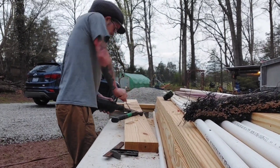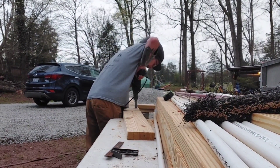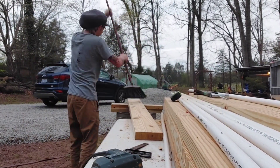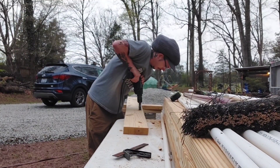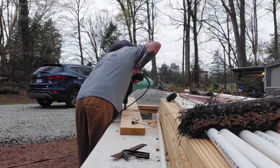When I first started drilling these holes, I was using essentially a hole saw, and all those little plugs kept getting stuck in it — really slow going, a real pain. I highly recommend using a paddle bit instead. I finally got wise and bought one yesterday. Makes it look almost easy.